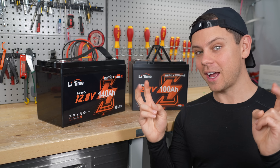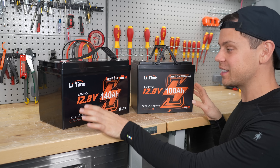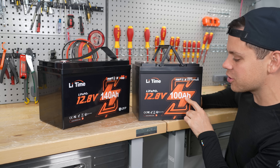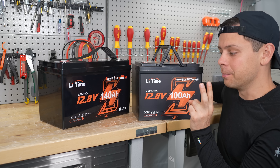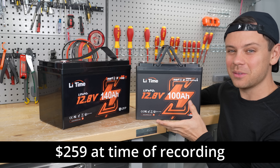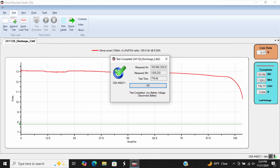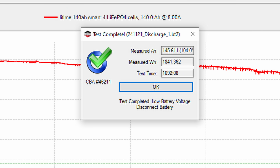So be careful when you look at these Black Friday deals because most of them aren't a deal at all. Now these batteries just got released — this is a 140 amp hour Group 31 with low temp charging protection, and this one is a self-heating 100 amp hour. They said this one is supposed to be very popular from their market research, but I really don't think at this price and with this feature set it's going to do that well. We can see what they've changed inside and if there's anything new. In my capacity test this one only pulled 103 and this one did 145, so nothing that special.